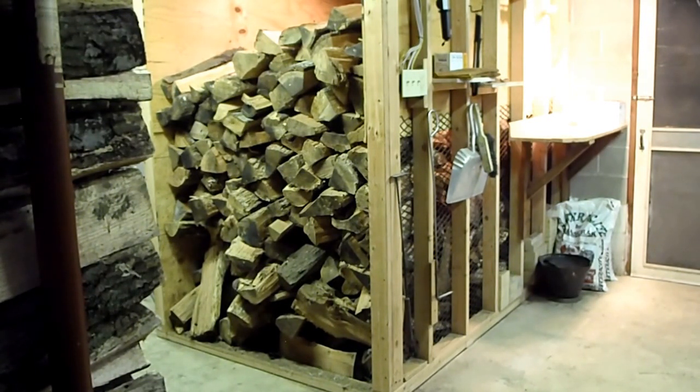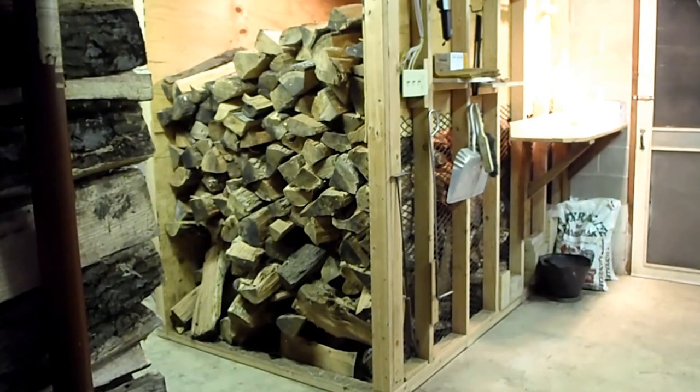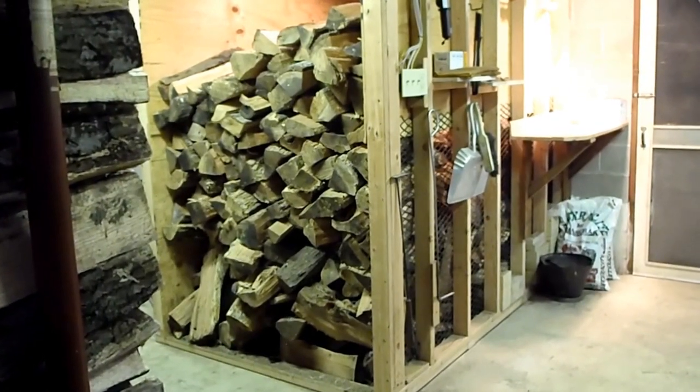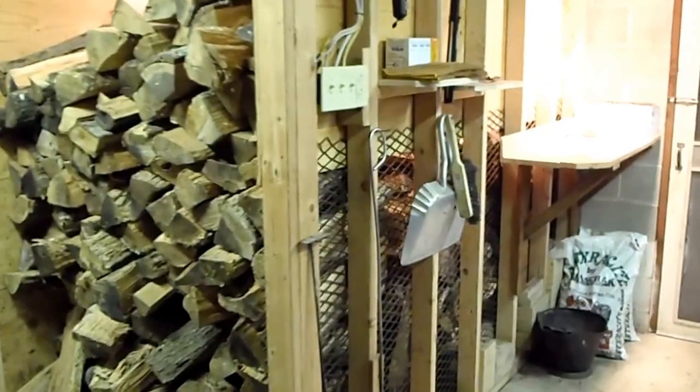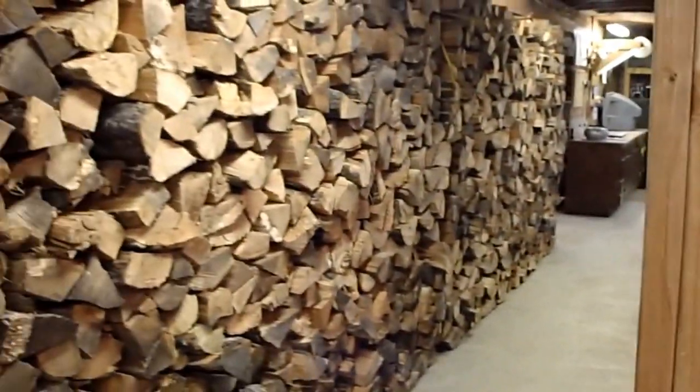This wood was stored out in the sun, in the middle of the opening, and we did get some rain on it. I let it dry a little more, but some more rain was coming, so I brought it in. I use the moisture tester to double check and make sure everything is good to go. Anything that's questionable I just put aside and let it dry down here next to the wood stove and run it around the next time.